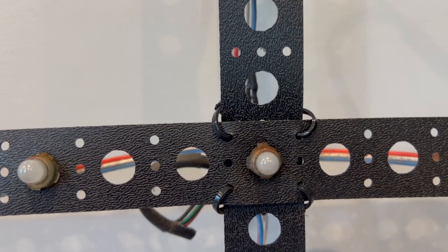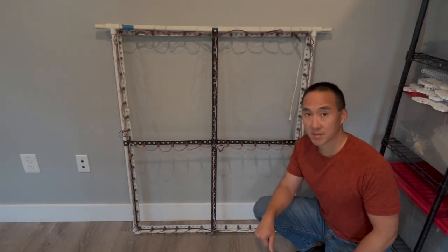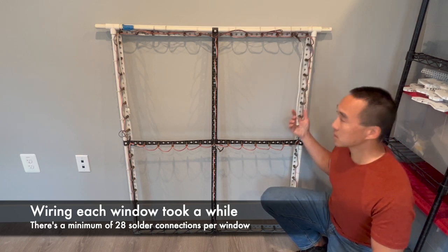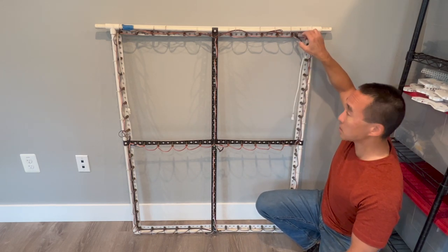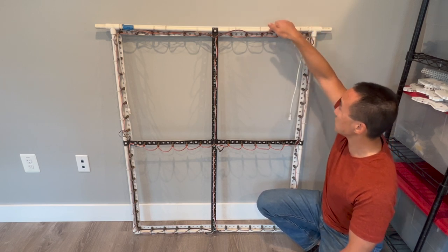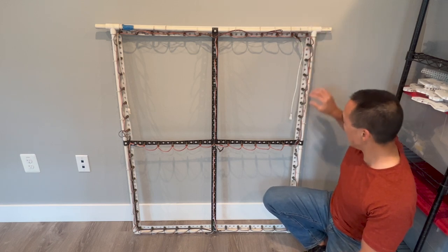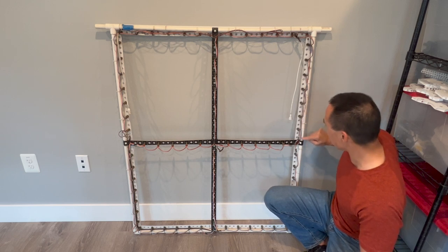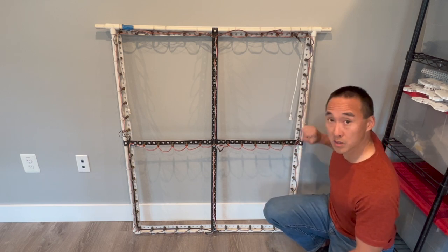You can see at the center piece on the front, I have four zip ties connecting the vertical in the middle. All the pixels, wiring, and all the window frames are the same. I have an incoming pigtail and an outgoing female pigtail. With all my props, I like to power balance — so off the V-plus and V-minus on the incoming pigtail, I have two wires spliced in running across and connecting to the last pixel. From the incoming pigtail, the first pixel actually isn't in the corner — it's down at the bottom. So I have a set of wires connecting the V-plus, V-minus, and data line to the first pixel. It's one in from the outside, so I can have a continuous run of pixels coming around the outside frame.